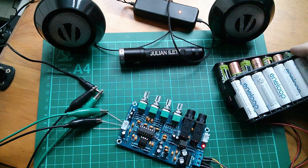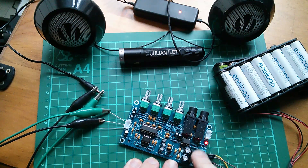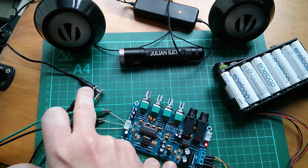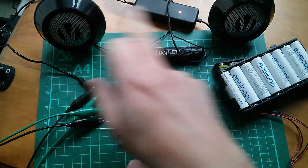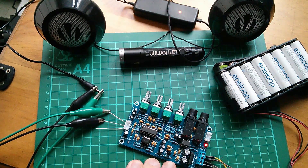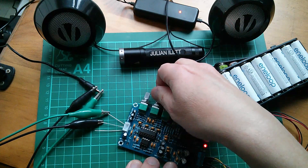Here's my setup. Lots of batteries here for power going into the power socket. I'm using DC, of course — it doesn't matter that this says AC, it's just going through the bridge rectifier diodes. I'm only taking one of the outputs, so I'm going mono for this. A couple of speakers. I think when you connect to the innermost and outermost pins, it comes out of both speakers. I don't have a microphone connected yet, but I've discovered you can have quite a bit of fun even without the microphone — if I turn this pot right up, it seems to have above unity gain. And the sound's building up.